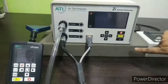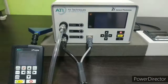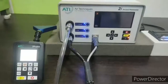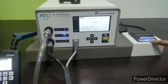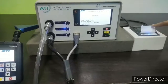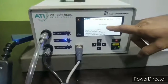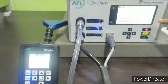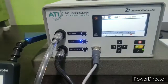Let's now start the instrument by pressing the power key. When the instrument gets started it will initialize first. The printer light will also come on. To feed the paper, press the paper feed key. On the display you can see it is initializing — the same display is also visible on the scanning probe. In the display we can see the serial number of the instrument, the software revision, and the number of days remaining for calibration.